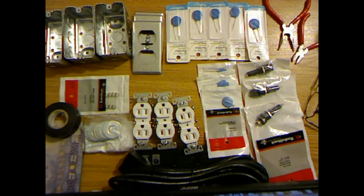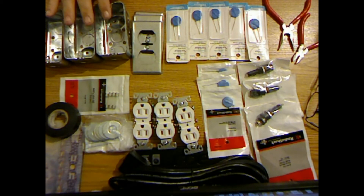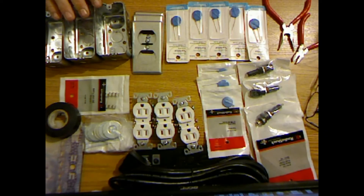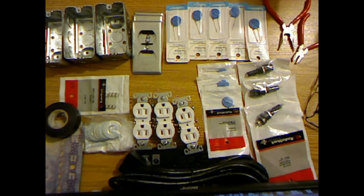I couldn't find the MOVs — metal oxide varistors — locally. These are the things that actually do the protecting. They take the voltage spike and they self-destruct. That's why we're putting them in metal boxes instead of cheaper plastic ones — in case they get hot, and they will get hot in an event. They should go very quickly, break apart, and break the circuit, but I don't want any fire. I looked up the information, got online, and compared different MOVs and different clamping voltages. I found comparable ones at Radio Shack.